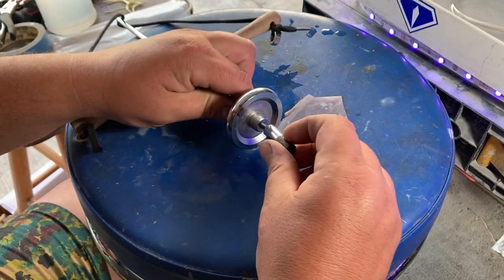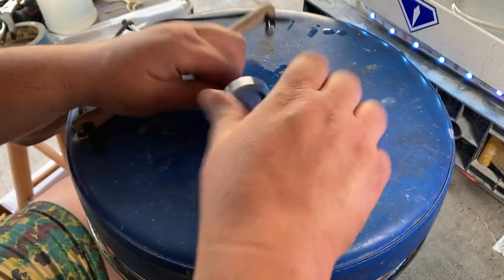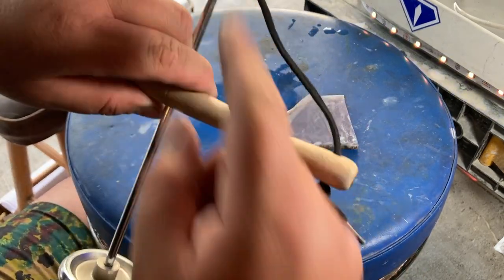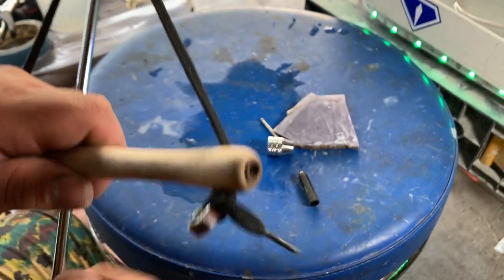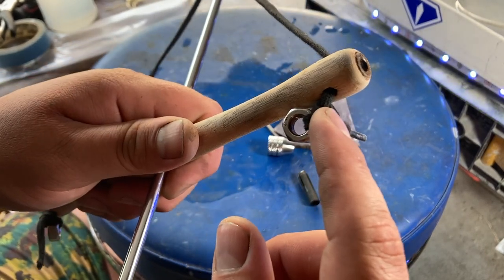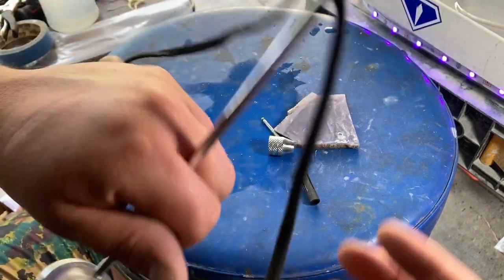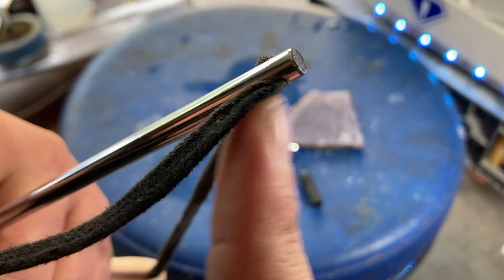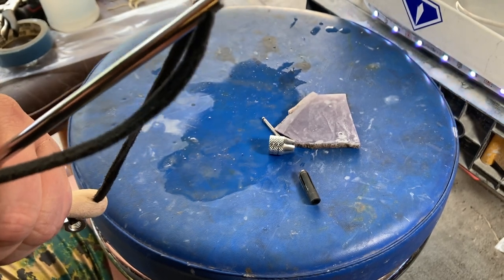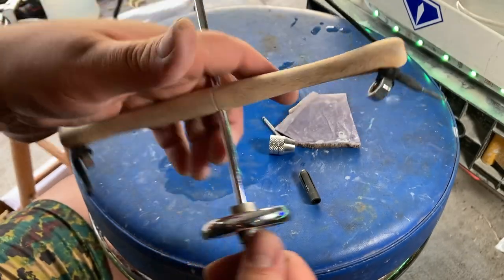A problem that I had at the beginning of the last time I was attempting to make this video, so I'm pretty much starting over now, was the string was falling out from the holes here because it was too thin. Unfortunately, the thickness of the metal up here and the wood down here are different. So I just used these little nuts. I've been using them for a couple hours now. They work really well. This metal up here is actually ripping the strings. Maybe get some shrink wrap or some nylon or deburr it somehow, because that's the biggest problem with this pump drill.